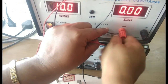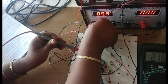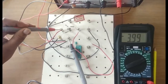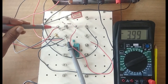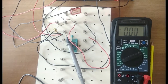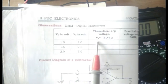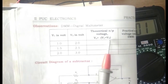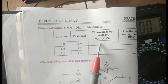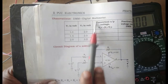If I interchange the positive and negative of V1, the formula is minus of V1 plus V2. Now if V1 is made negative, I should get a subtracted value. When V1 becomes negative and V2 is positive, even the adder can act as a subtractor — this is another viva question. If both are negative, it becomes just V1 plus V2, because the two minus signs cancel. So these are some viva questions to remember.